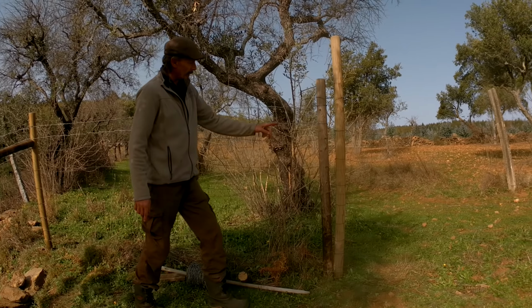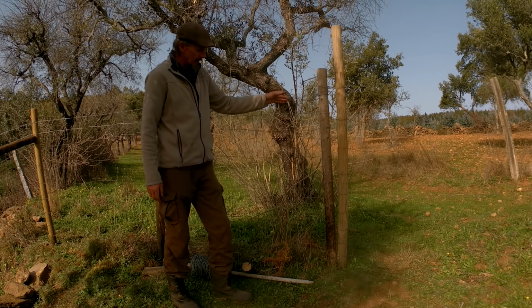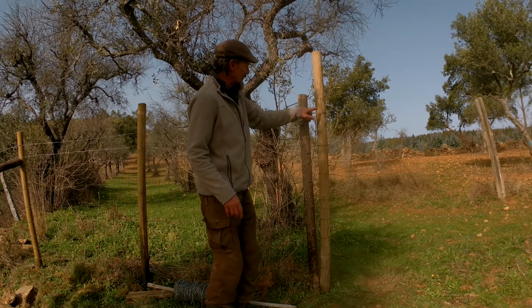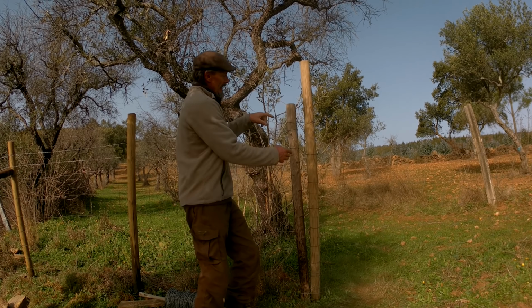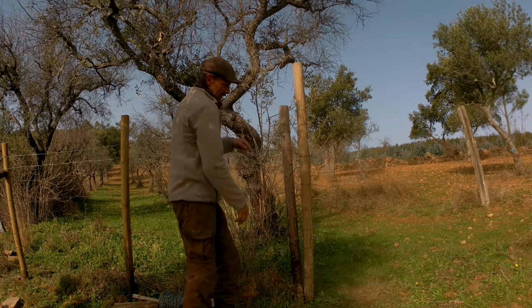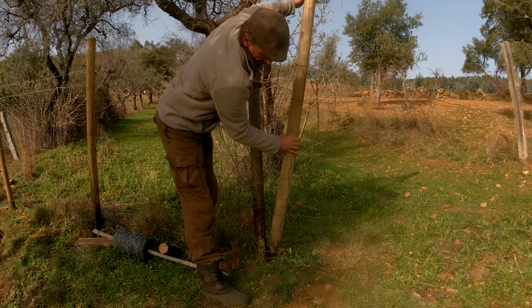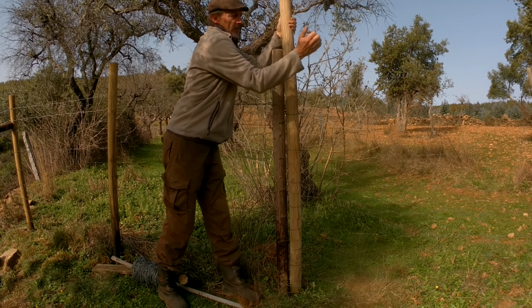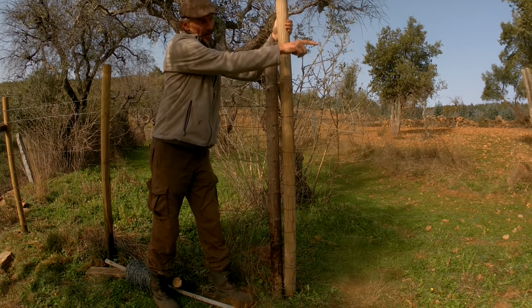The reason why this gate post, when I was tensioning this up, moves in a little bit, it's sort of like a bit of a Portuguese gate that I've adapted. They often have a piece of string and a stick, and they can use the stick as a lever, and it pulls the rope in and it pulls this in. This is a gate. I've got to put more wire on the top to match the height of this, or they're just going to jump over this. But normally you pull it, there's a little wire hoop on there, there's a hoop at the bottom which you put the bottom of the fence post in, and then as you tension this back, the fence panel here goes tight, and it also pulls this one back that way.